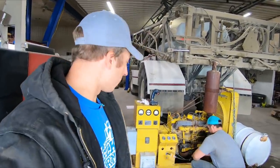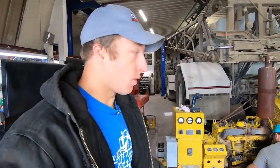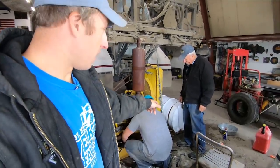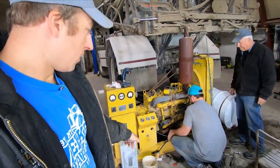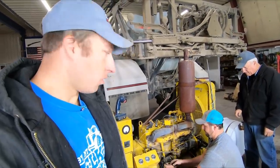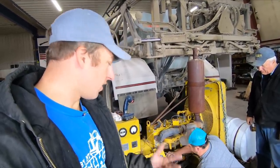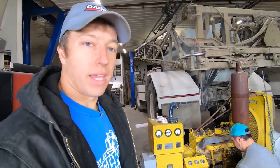We're still tinkering with this generator. Leg Arms just went through a lot of the wiring on this side and cleaned up a couple things. We found that one of the breakers that runs the 110 outlet was popping every time you started the generator — tested it and sure enough it's faulty, so we got a new breaker in there. Right now we've got the fuel tank in the front — it's a 30-gallon drum barrel that came with this thing but wasn't hooked up. We mounted it on the front, running the steel line over. Leg Arms put in a new inline filter as well as a primer because the primer on the fuel pump was sketchy. We should now have good prime and good filtration to the engine. It's got new plugs, new gas, and we're ready to fire it up and test if the generator side is working.